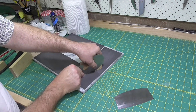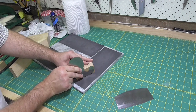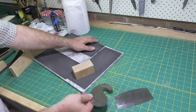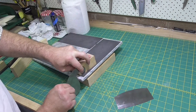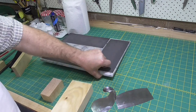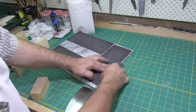This is the technique I was taught for sharpening a scraper for woodworking — taught decades ago — and I didn't change it at all for using a scraper for bookbinding. Sometimes it feels like there's an infinite number of explanations on how to sharpen a card scraper, but I think the reality is they all come down to these three steps: square up the edge, polish the edge, and produce the burr. All the variations are minor variations on those three steps.